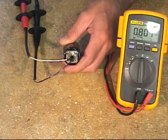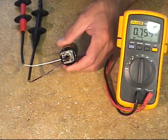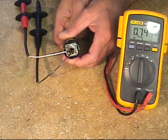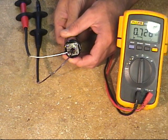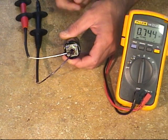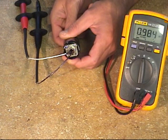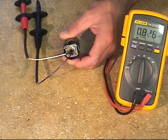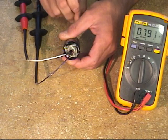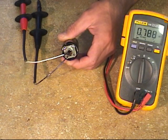We're starting off at about 803, which is a little high — this could be a bad one. On the troubleshooting worksheet there's a chart to log the highest and lowest resistances. Let's turn it just a hair and then let go. We see 745 — that's the upper limit. Turning it again, there's an 830, so that's out of range. Notice I'm moving the transducer a small tenth of a turn or less, then letting go, then observing the resistance.